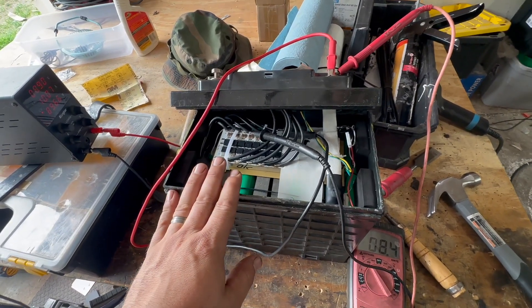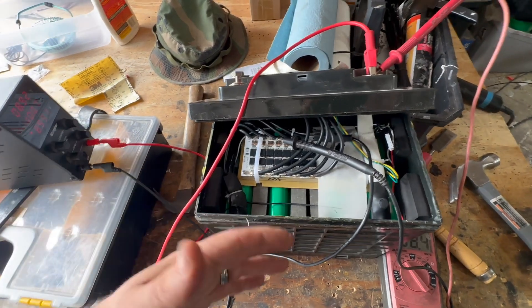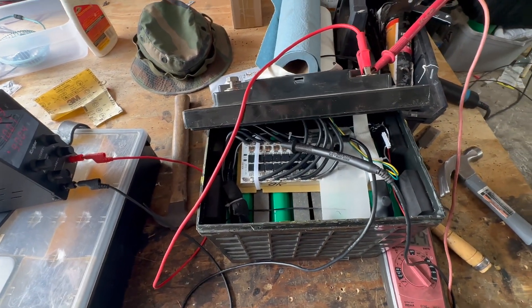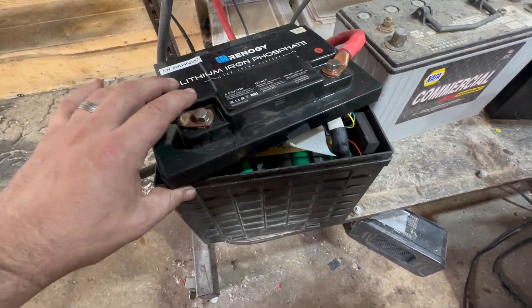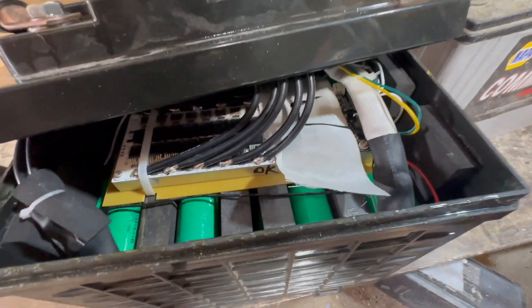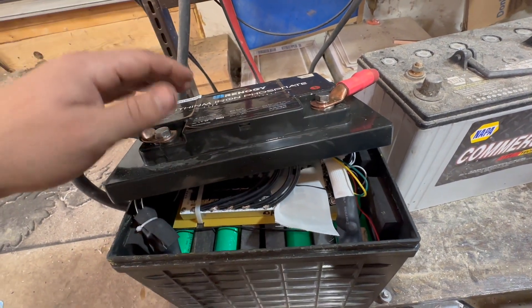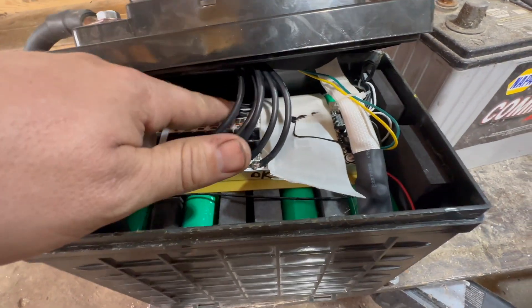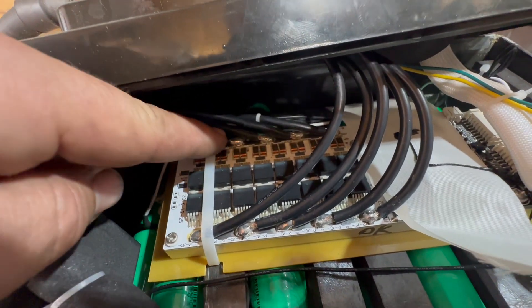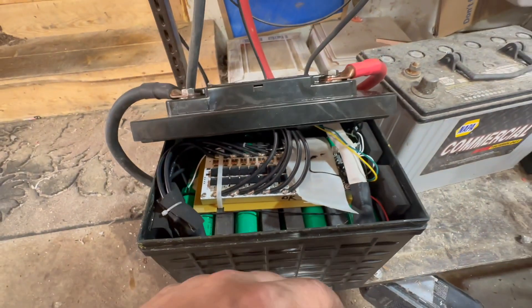I'm not sure it's going to work on this one — the customer gave me two batteries to try and revive, and I think I've got one going. So I decided to tear into this one too. I got it charging on the test stand. I had to jump it by plugging into the positive here — I was getting no volts at the negative, so I had to charge right on these MOSFETs. I just put the alligator clamp on there and charged at about 10 amps until the voltage came up.